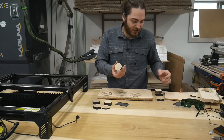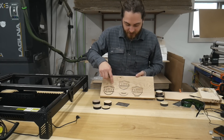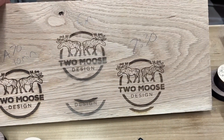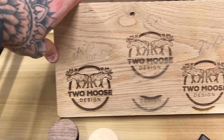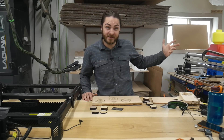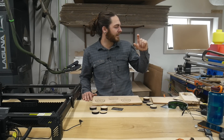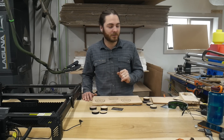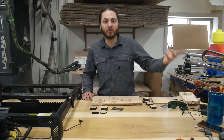If you really dial it in you can get the CO2 lasers to cut a little more efficiently. For engravings I messed around to try to get a similar depth and color — the CO2 laser took 7 minutes 30 seconds and the A70 took 10 minutes, though it cut a little deep so I probably could have sped it up. The CO2 laser also has different lens options: a two-and-a-half-inch general use lens, a four-inch cutting lens, and a shorter lens for engraving to get more detail — something you could use to further improve your CO2 laser results.